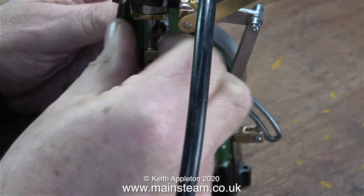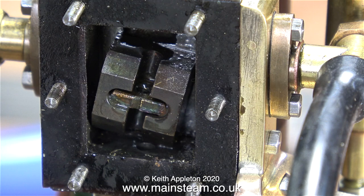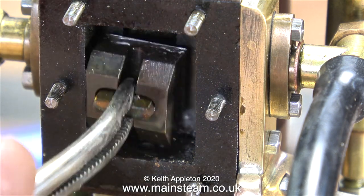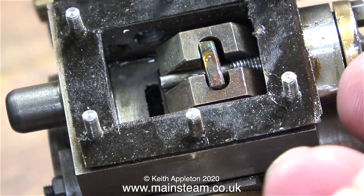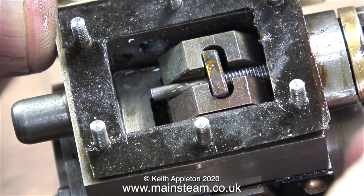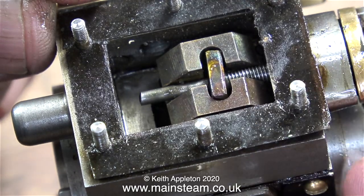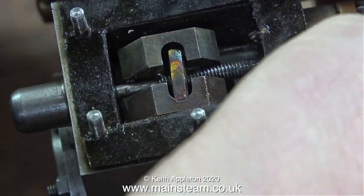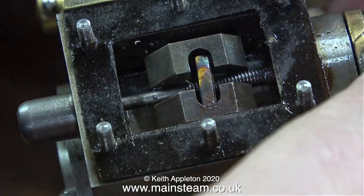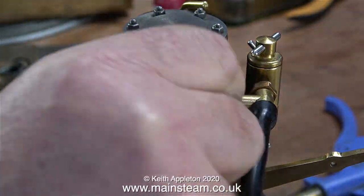Then I took the valve gear apart again — this time even removing the valve spindle to take out the valve. I checked the dimensions of the valve against the drawing, and the valve is exactly the same as on the drawing. In this clip I'm refitting the valve. As you can clearly see, the hole in the driving block is not threaded at 90 degrees to the driving block, but it works anyway — it's not cross-threaded, just a bit wonky — and this has no bearing on the problem whatsoever.